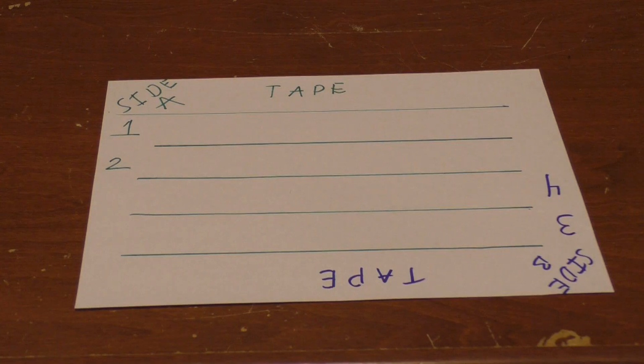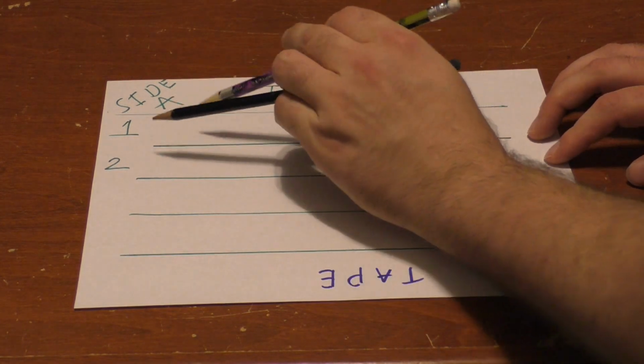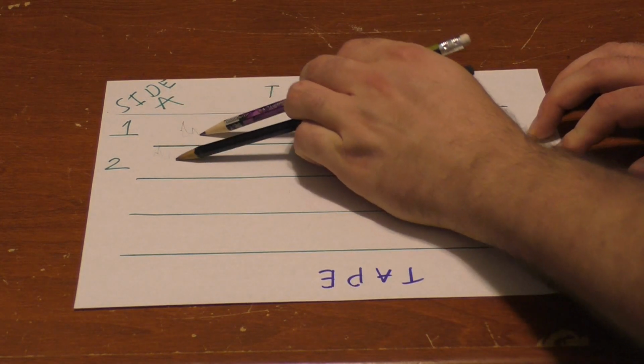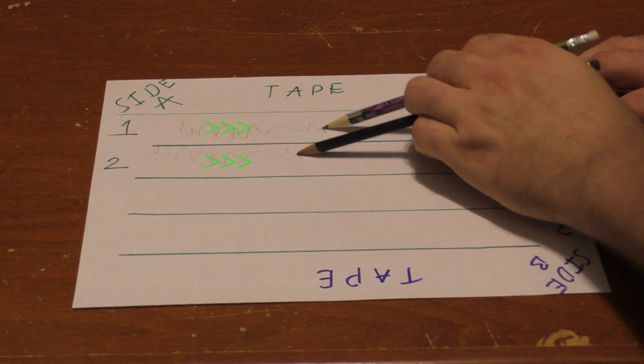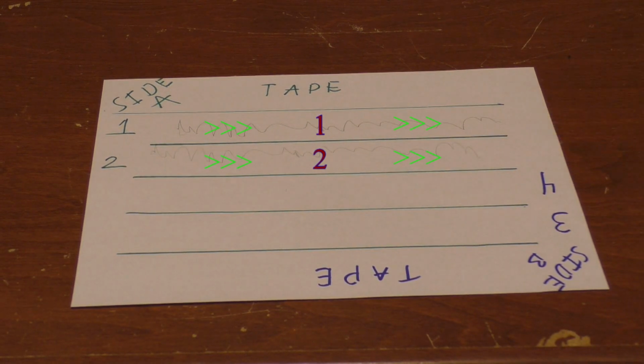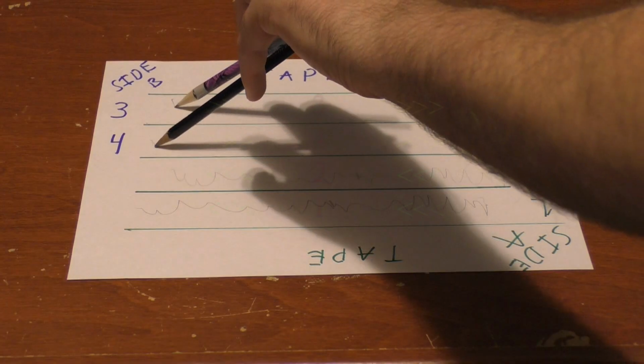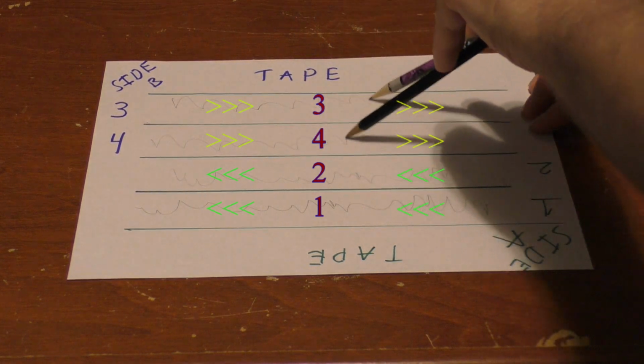And say for a second that this drawing is a zoom-in of the recordable tape itself. The recording area on a tape is divided into four tracks, and an electromagnet, called the head, translates sound into a set of magnetic pulses, which then magnetizes the metal particles along the surface of the tape, recording the left and right channels along two of the tracks, which is how it records stereo sound. When one side runs out of tape, turn the cassette over and use the other two tracks to make a complete tape.